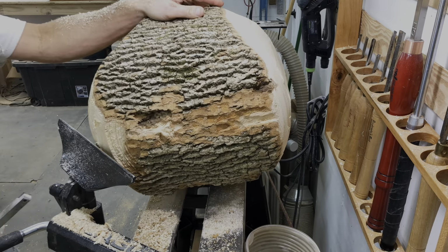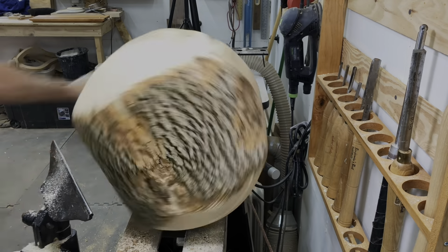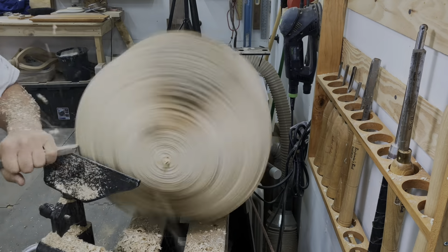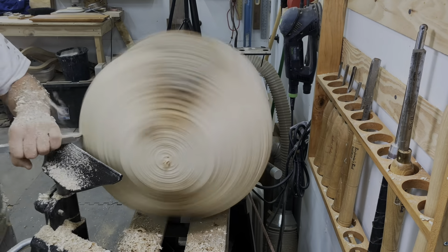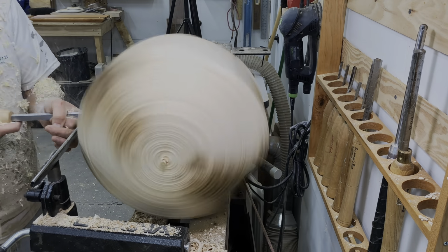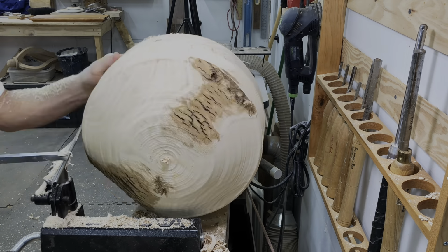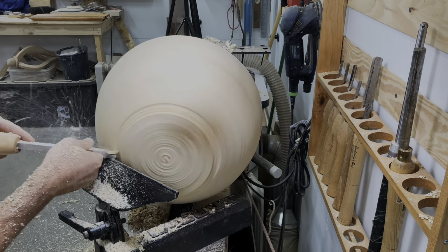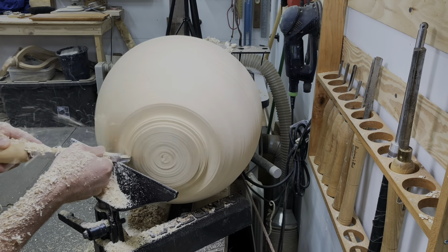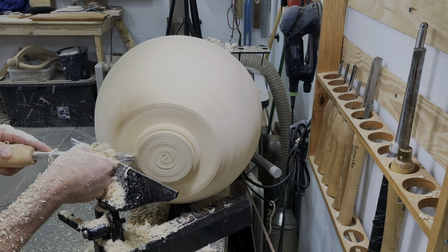before. It's developed from Betty Scarpino, and I'll put a link down in the description of a PDF file from her website that gives step-by-step instructions on how to use dye and liming wax to kind of highlight your finished project. And her process is really preferred on woods with an open grain structure, and ash I knew was a perfect candidate for this, so I wanted to get her instructions and follow the process and try a step I've never actually done before.